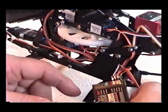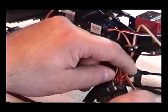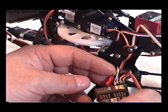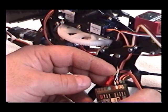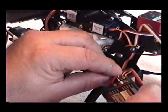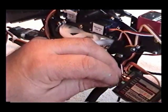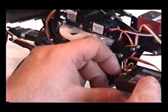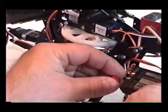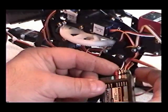Sometimes you wish you had little fingers. Okay, now the Futaba connector on my gyro, I got a DTrum. It's a GY48V. I'm looking to get a newer one. I'm kind of fond of my GP750 Aligns. They work really well. Very simple to use for a newbie like myself to set up. The DTrum has got dials, and if you don't get them right, she still glitches all over the place. But the Futaba connector was already red on the gyro gain, which is your yellow wire. So I just painted red on the receiver.